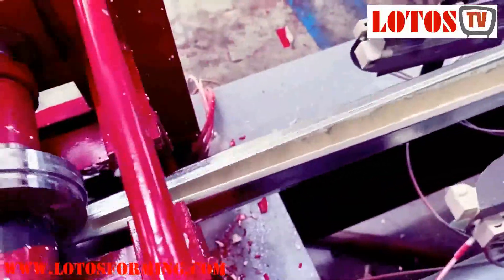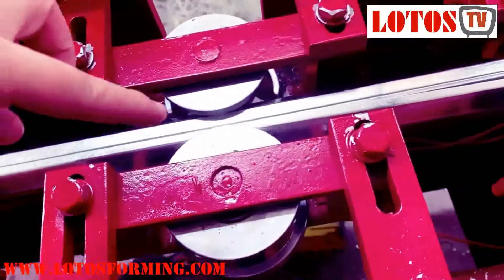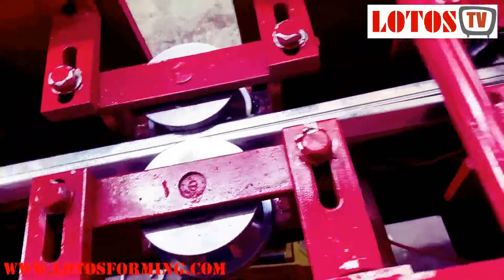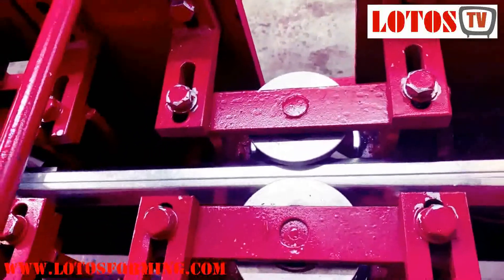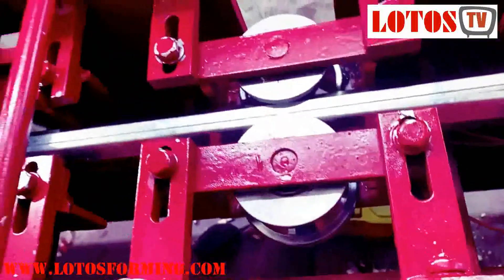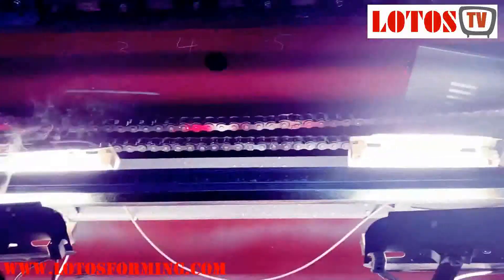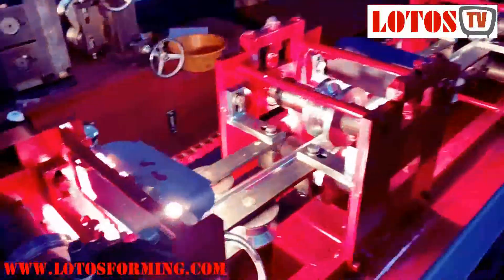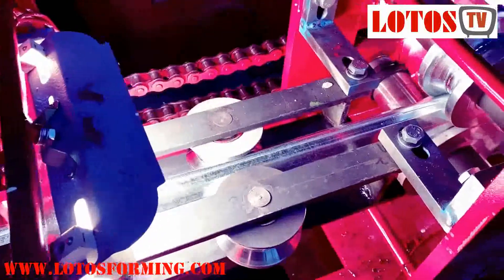My engineers tell me that once we do the forming, we have to check here. If the foam is leaking from the clamping side, we should run it more fast. The forming speed is fixed, but we can adjust the running speed of the profile. We have to run the profile faster than the forming, because if the forming speed is faster than the clamping speed, it will leak out from the seam. At low room temperature, we have this heating to make sure the forming will form on time. Here is the heating system — it will be very useful in winter and at low temperatures.